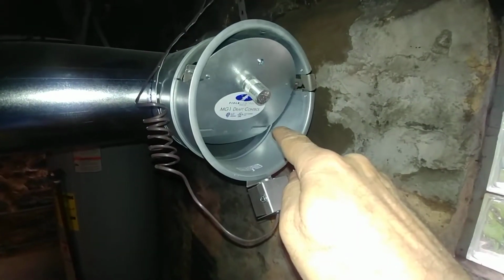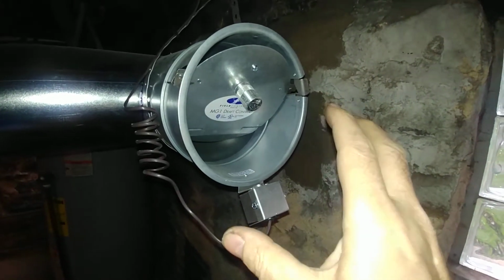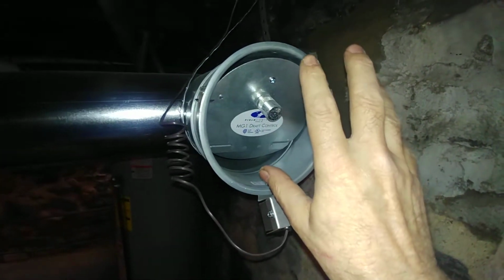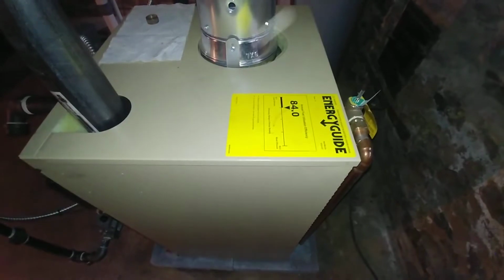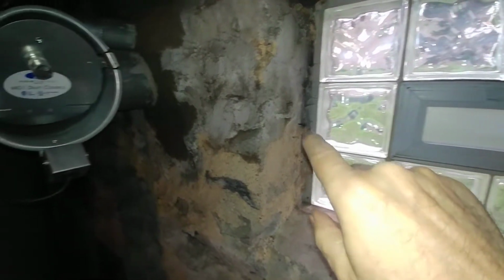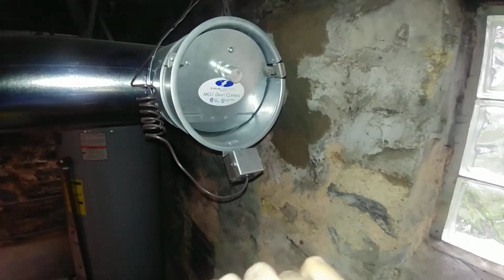As you can see here, the chimney, as it heats up, begins to draw more and more. So this draft will increase, but this allows the chimney draft to increase without affecting the draft at the burner chamber. So you see, there's the wind blows. As the wind blows, it changes the draft moment by moment.